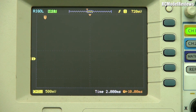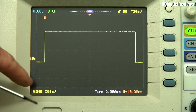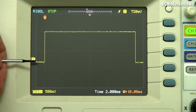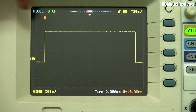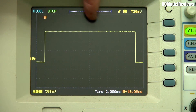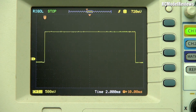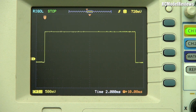Let's try it out. I'll plug in the battery - and look at that, exactly what we expected. We have 500 millivolts per division, and we've gone up three divisions - so 1.5 volts, which means one and a half amps was flowing in that circuit. And it flowed for 10 horizontal divisions, which is 20 milliseconds or 1/50th of a second. So in 1/50th of a second, this thing figured out that there was too much current flowing and shut it down before that delicate piece of electronics could smoke and burst into flames. That's how it works.